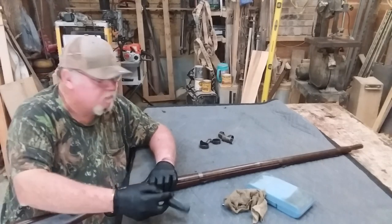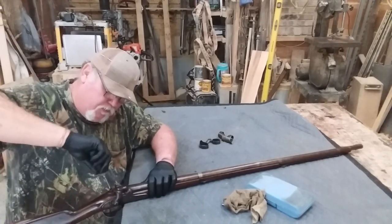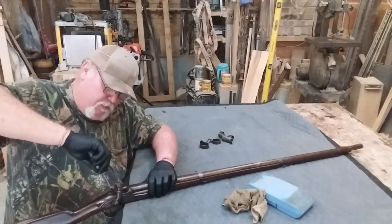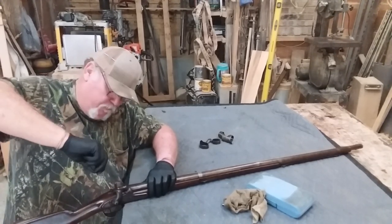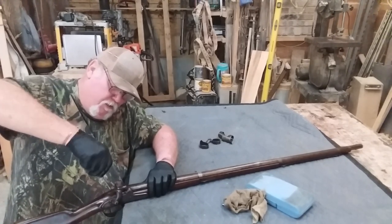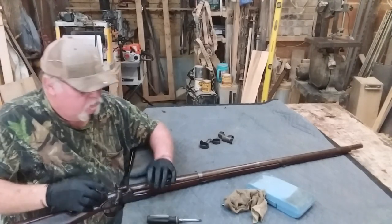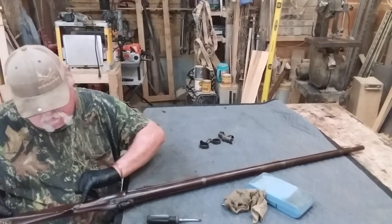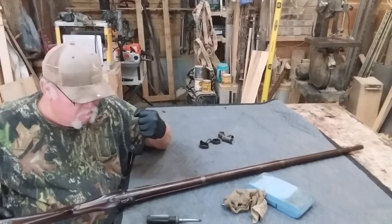I use linseed oil quite a bit on my stocks nowadays, because I don't have a giant pressure cooker. What I like to do is take paraffin wax and linseed oil and heat it up — carefully, outside on a little stove. If it starts to smoke, you get it off the fire, because when it starts to smoke it's fixing to light off. You want it just before ignition, so to speak. Then you put it on your raw wood while it's hot, painting it on with a brush, and the wood just sucks it right in. What's nice about the linseed oil wax finish is that whenever you get a ding on your gun, after a couple of days it darkens right up and doesn't show. It's not like a varnish finish — the oil is down in the wood and it'll come back out.